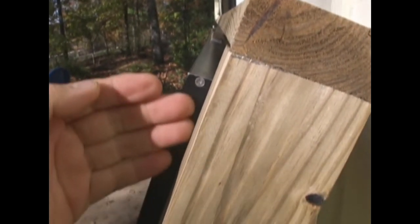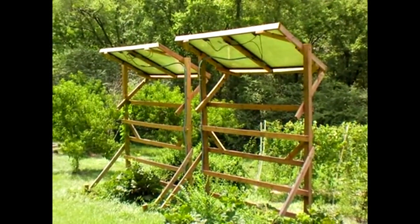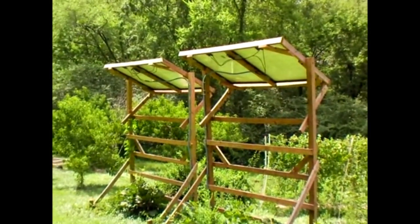Why do the panels protrude? On this side I like to have a shorter drainage path for rain and snow to get through. You can make an inch or so spacing on the top and bottom of the panels, but because you're using the mounting plates, the clearance on the left and right will necessarily be less — about a quarter inch — such that when you mount those plates in there the holes will line up. That drainage channel is a little narrower, so if I raise the panels up slightly, it takes a little less effort for water and debris to get through. With these type of frames, the large mounting poles go on the outside of the frames where you put the axles through, allowing you to adjust the angle seasonally.